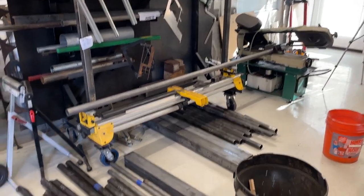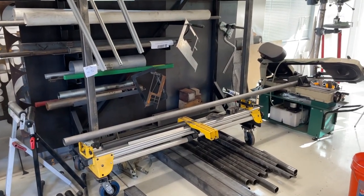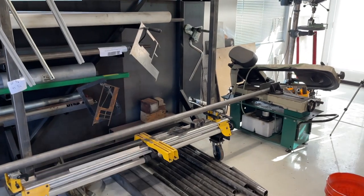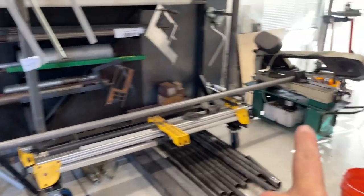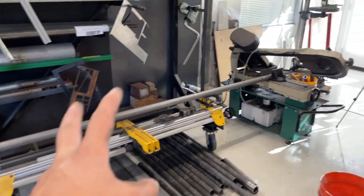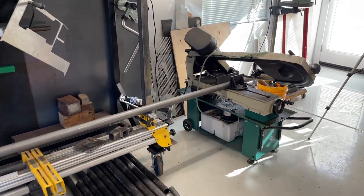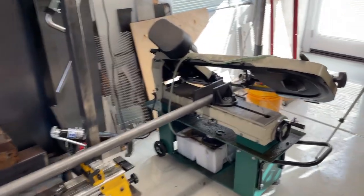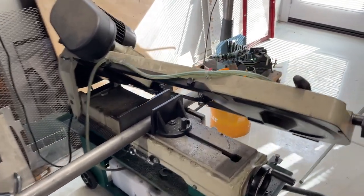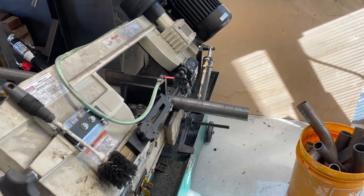This was not one of the tubes we cut at Bentec - like you see all the ones down here which are ready to go with all the copes. I was going to save this one till I got back because it has a bend and it'd be too big to create all those things there. This tube is being cut at 105 and three-quarter inches. I've measured it, double-checked it, triple-checked it - a 105-inch tube is an expensive tube. You mess it up and there's going to be some tears. Anyway, let's go ahead and chop it off at the band saw, then clean it up, start marking it, and get it ready to bend.